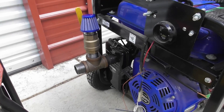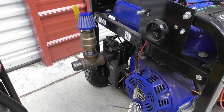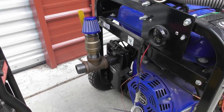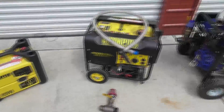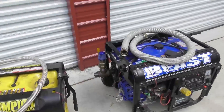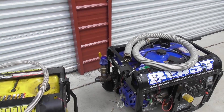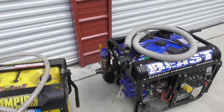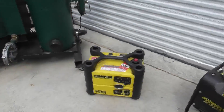Once it's set, you don't have to keep adjusting it unless you're really changing the RPMs on the engine. You can make some fine tuning with the ball valve. You can also use an electronic valve in place of the ball valve to make that air-fuel mixture adjustment automatically. I've got separate videos out there for that if you want to check it out.